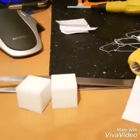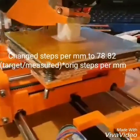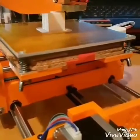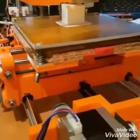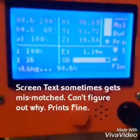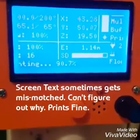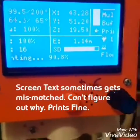These were 20.3mm wide and long, so I've just backed off the steps per millimetre in Repetier firmware. A couple of issues: first, the bed won't heat up without the nozzle, and I'm still getting strange artefacts on the screen — half the text is missing. It doesn't affect printing but it's just not very good. The A-Net does that but you can just click back and it goes normal; this one doesn't, so I don't like that.